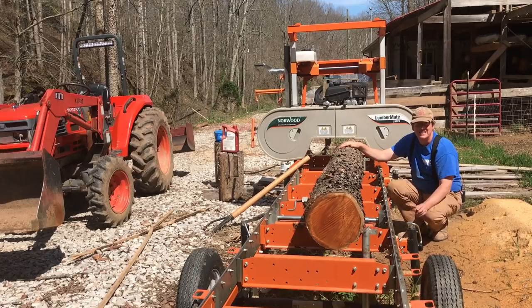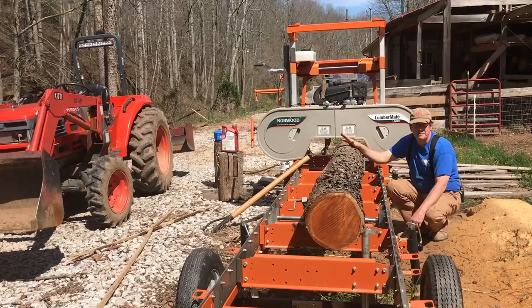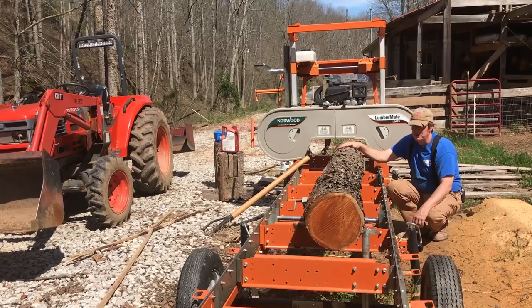It's a hard wood, but yet it's not super hard. Doesn't have a hard density. That makes a lot of sense, right? It does burn a little easy on your tools. That's why you got to have sharp tools. Your router bits, your table saw blades. You can leave a burn mark in it pretty easily. But man, once it's cut and it's in a piece of furniture and you've let it patina over some years, let it stay outside and oxidize, it really turns a beautiful dark cherry color. So what I want to do with this log is just square it.